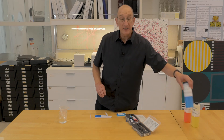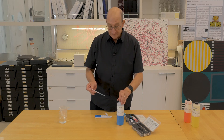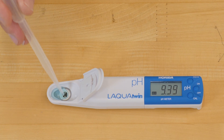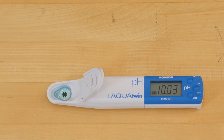To measure pHs above 7, we need to calibrate with pH 7 and pH 10. The Horiba meter only comes with 4 and 7 calibration standards, so we use a standard from another company or source to calibrate. We put in our calibration solution to cover both electrodes, get rid of any air bubble, wait for the reading to stabilize, push the calibration button, and wait for the meter to self-calibrate to 10.01 pH.